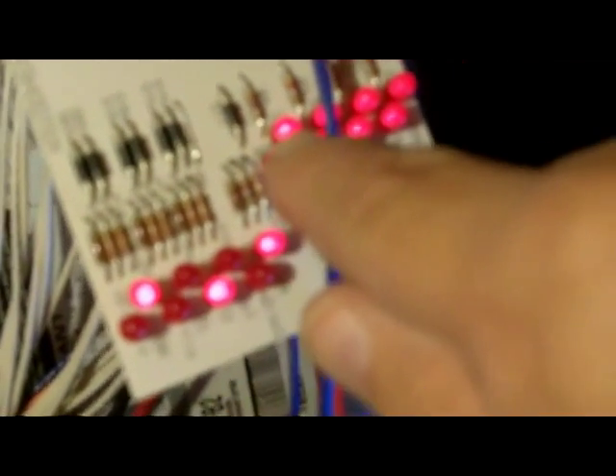You can hear the motor starting to come on — it's starting to run. That is the go/no-go test. This board diagnoses all the thermostat connections, all the dip switches, and will also run the motor. If you've got all your signals coming from your thermostat and all your signals from your dip switches, that little board with the flashing LED is good. The go/no-go test confirms the motor is good, the board is good — so if the motor's good and the board's good, the module is no good. That's how you troubleshoot using Trane's little tool.